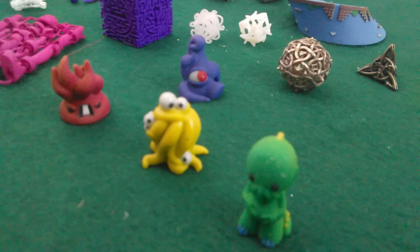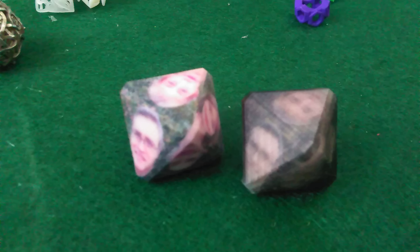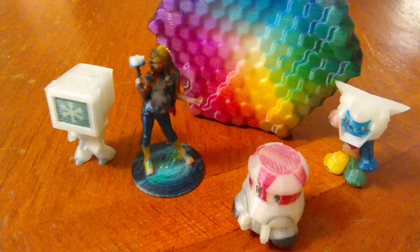Of course, there are some 3D printers that can do full, full color. These prints aren't even taking full advantage of what these 3D printers can do, and the printers that can do it are very, very limited. You pretty much only have two options: you can get a DaVinci Color — for which there is now a DaVinci Color Mini — or you can order a print on Shapeways and they'll print it in sandstone. These are also limited in material. The DaVinci Color only works with their very special blend of PLA, and Shapeways only does it in sandstone. So if you need the material properties of nylon or PETG or something else, you're out of luck for full color. The results of full, full color 3D printing are super, super impressive, and I still think we should explore it more.